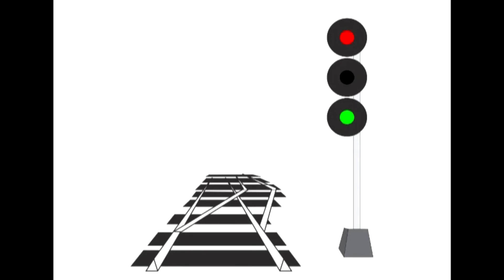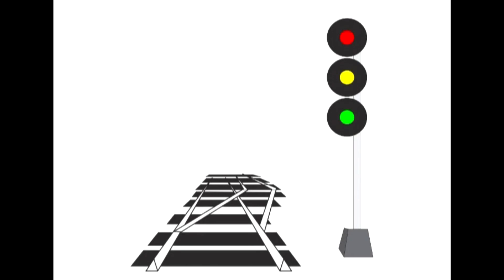This is where things get more specific and rules-driven. We have the Canadian Rail Operating Rules, where the agreed-upon signal configuration and meaning is laid out. What was decided was that this signal would mean slow to medium. We can't use the top head because that indicates track speed, so we use the middle head with a flashing yellow to indicate slow speed here and now at this signal. The next signal down is represented by the bottom head. So we pass by the slow to medium signal at slow speed, and once our train has entirely gone through the switch and passed the light, we can accelerate to 30 miles an hour — medium speed — because we know that the next signal will be a medium speed. This signal is slow to limited: pass this signal at slow speed, expecting to pass the next signal at limited speed. It's the exact same signal we just saw, but the next medium signal indication has been upgraded to limited speed.